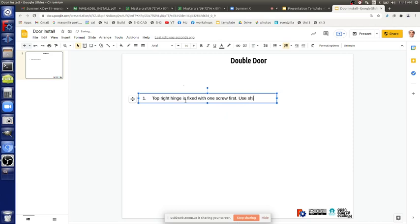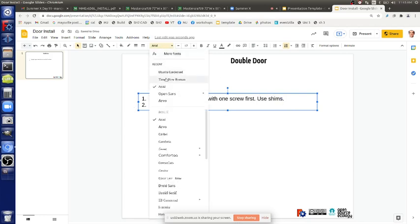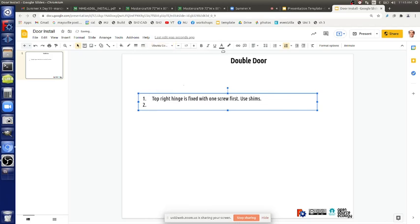Yeah. And then use shims. And then I think measure, that's everywhere. So we don't have to really say that. And not over tighten screws either, and risk moving it about, right? Exactly. Shims are thin, the drills are powerful, and just like the shims, we probably need to do that lightly. Check everything, and then maybe with the final screws is where you're fixing that for sags.